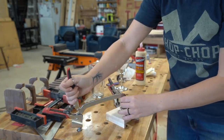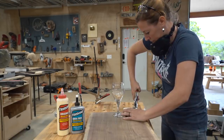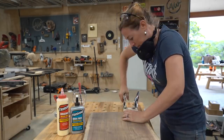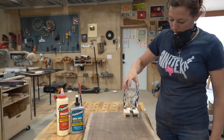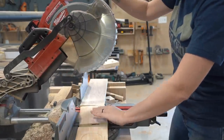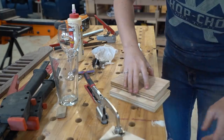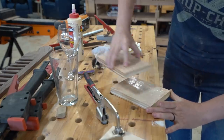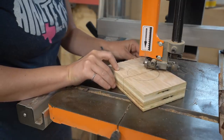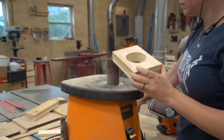You can also just cut a slit into the slab itself for the glass to be inserted into, but then you have a portion of the glass that hangs below the caddy. By placing it on top like this one, knees won't have anything to bump into. Now for some candle holders, I wanted some slight recesses in the slab. To make these easily, I first made a round template so I could use my router to cut them in. Tracing out a candle, I cut it over at the bandsaw, then used a spindle sander to clean right up to my pencil line.